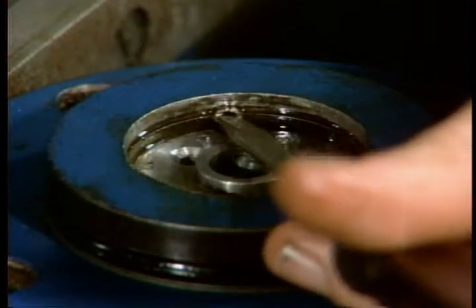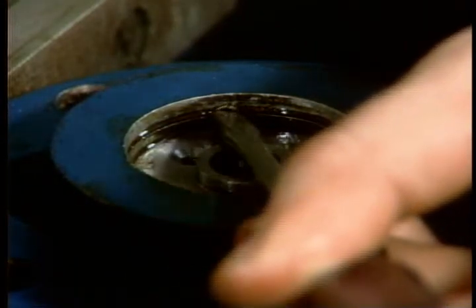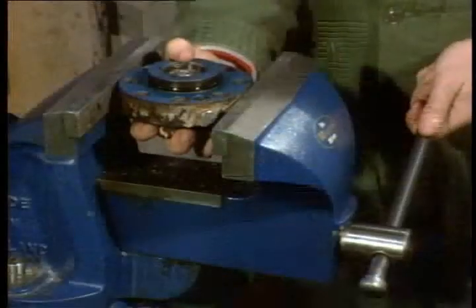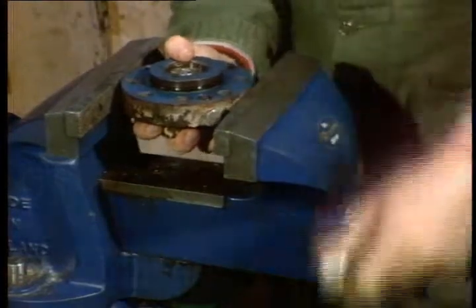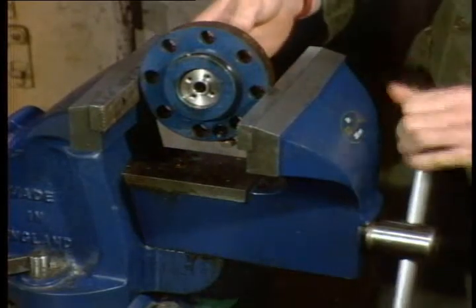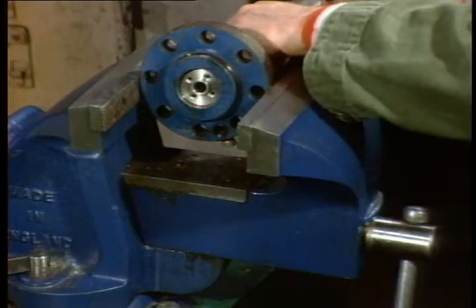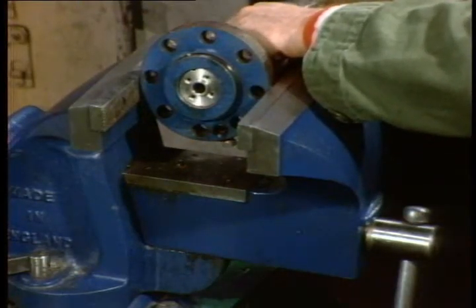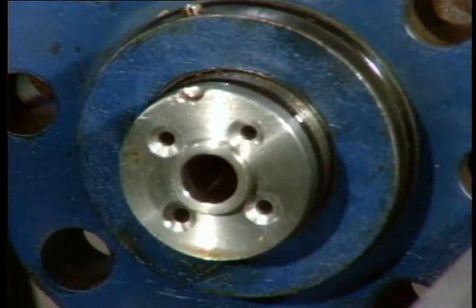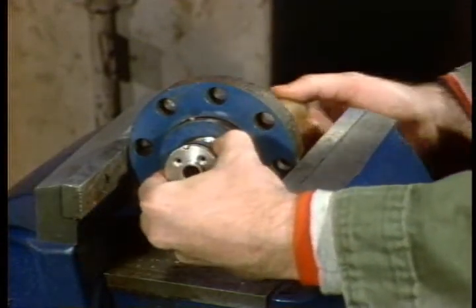Several precautions when you pull the pilot valve housing. First, tap this spring pin back into the body. Make sure it's all the way back out of the way. If the spring pin's not completely back, it'll gouge the housing when you tap it out the top. It is best to tap the housing out the top instead of the bottom. The large O-ring around the body may force you to use a brass rod to get it out. And since the O-ring is at the top of the housing, you'd be fighting it all the way if you tried to push the housing out the bottom. Be careful as the housing is about to come out.